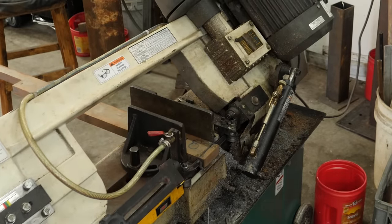The next thing we're going to work on is the handle — it's time to get this bad boy shaped up. Since we made the handle out of scales with a frame piece in the middle, both scales are the same thickness so everything is already profiled side to side. I'm trying to be as safe as I can while working with the carbon fiber — I'm wearing rubber gloves because you can get tons of little splinters from grinding it. I'm also wearing a respirator as much as possible and I've got a giant vent fan sucking all the dust away from the grinder.